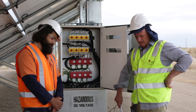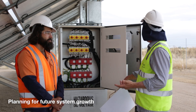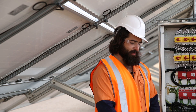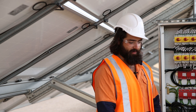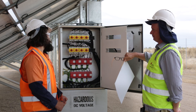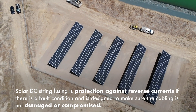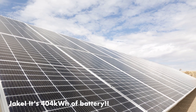Have we made provision for extending this site in regards to the conduit size? There is possibility to expand on the sizing if required. We have a bit of room left in the DC conduits, and we also have that 40mm conduit with only the instrumentation cable which we could also run DC through. There are two isolators left in the combiner box, meaning we could put four strings or incorporate fusing and do six if we chose to. The 100-kilowatt solar and 100-kilowatt battery is definitely a sufficient size for now.